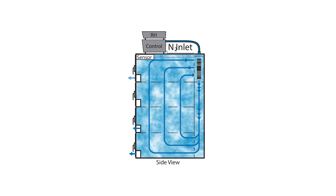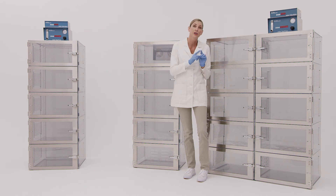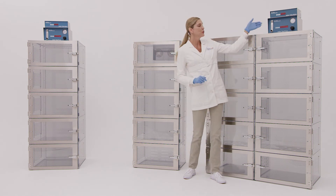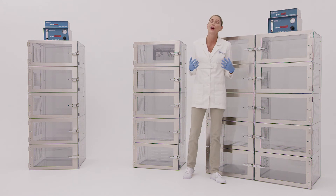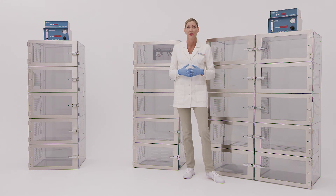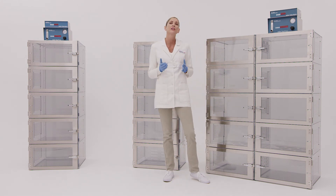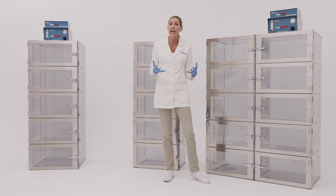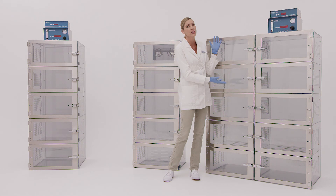Now the nitrogen watch sensor can detect the increased humidity sooner and trigger the dual purge to compensate. As you can see, the patented ISO-DRY desiccator is much more proactive than a standard desiccator. Conventional systems have a slower recovery rate because they depend on nitrogen gas expanding and dispersing on its own, which is especially problematic in larger desiccators.